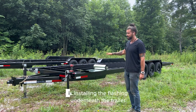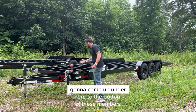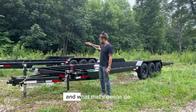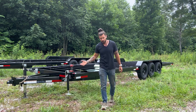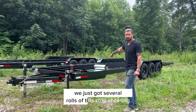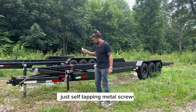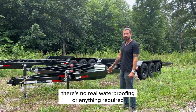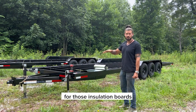What we're doing today is installing the flashing underneath the trailer. It's gonna come up under here to the bottom of these members and seal it on. And that's gonna give us a surface to lay in our insulation foam that we'll be doing on the next video. It's a pretty simple process here. We've just got several rolls of this strip sheeting. We're gonna come through with self-tapping little screws and attach this to the bottom. There's no real waterproofing or anything required. All it really is, is a surface under there for those insulation boards.